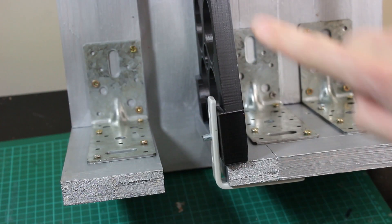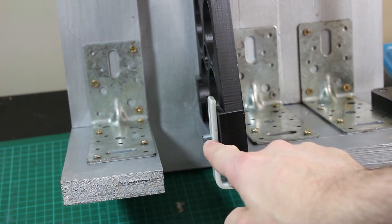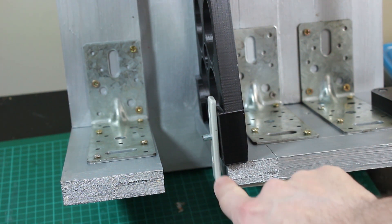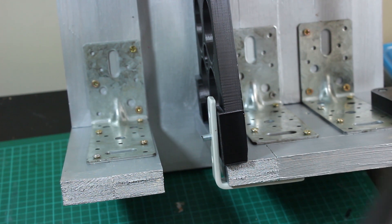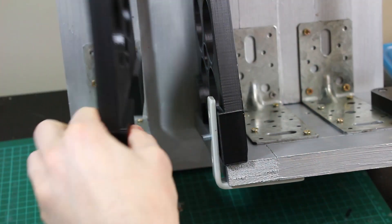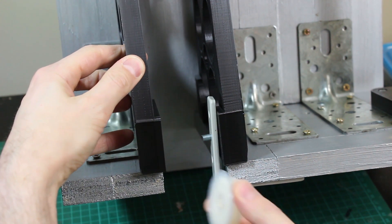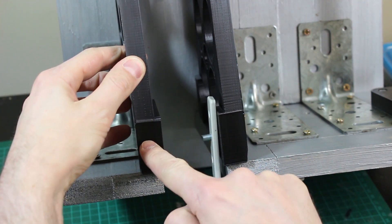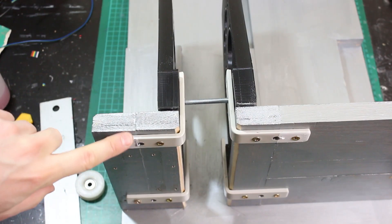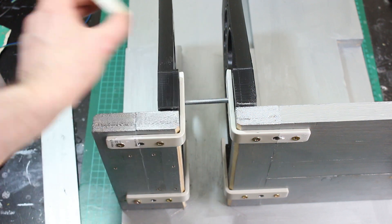I've printed these out — one on this side with an L-bracket underneath and a bit of 6mm studding stuck in. I need to knock the corner off the wood to get this bracket right back and get everything aligned. The other one sits the other side, the pulleys sit in the gap in the middle, and another L-bracket on this side holds three pulleys between the same bit of studding. Each of the four brackets has studding between them where the actual pulleys go.